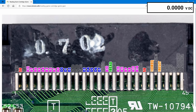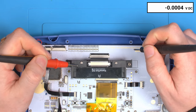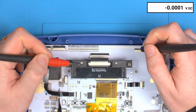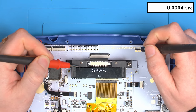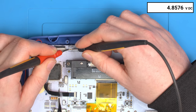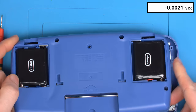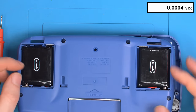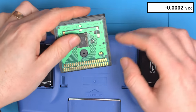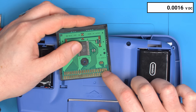Looking at the cartridge connector pin, you can see it's pin 1, 2, 3, 4 — so we know it's the fourth pin over on the right on the cartridge connector. The issue is this should be 5 volts with an EverDrive, and that works simply because Master System games do nothing to that pin, while Game Gear games short out the fourth pin to ground.